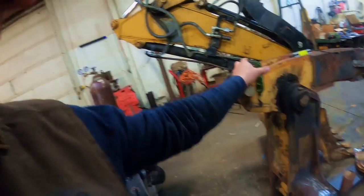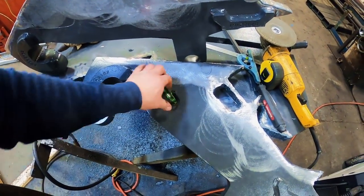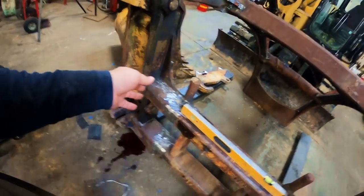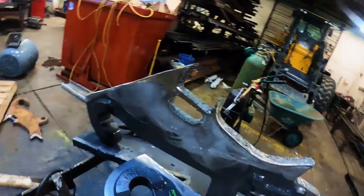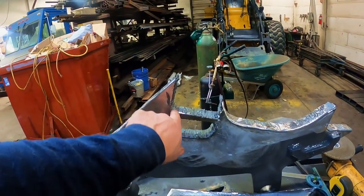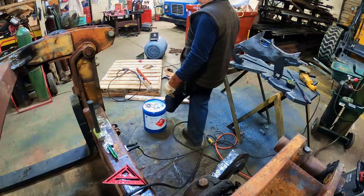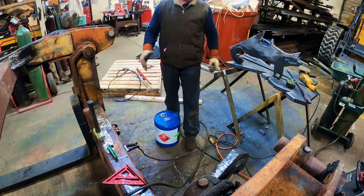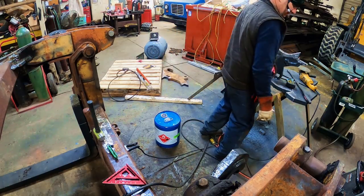That's what we're after. Now we're gonna set them up there, and all we gotta do is plumb them with our magnetic doodad stuck on there. And then we'll get the first one into shape and get him set in there. And then all we gotta do is make sure the second one's perfectly up and down. Because I got a little torch booger here, I'm gonna have to cut off on this one. It's kind of sloped in, so I'm gonna mount this one and then make that one match this one. And I'm gonna take a chance and tack it, and then I'm gonna come back and measure to where I might have to bust the tack loose and move it if I'm wrong. But we'll just see where we get.